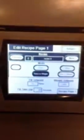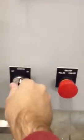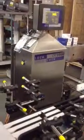And we're going to come right back around here. We're going to go into segment 2 in a second with just the PLC stuff. You still really can't see it too well. But you have some switches here, conveyor off and on. You can hear the conveyor turning on. This is your fill motor. This is the motor in the back of the machine. That has to be on for it to run. That's your emergency stop and start switch. We're transferring right onto the metal detector, and then right onto the check weigher. And in segment 2, we'll go over some of the PLC stuff. Thanks.